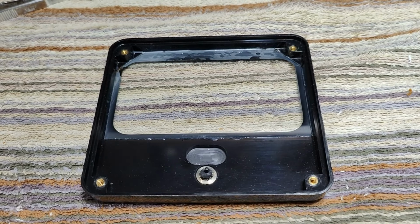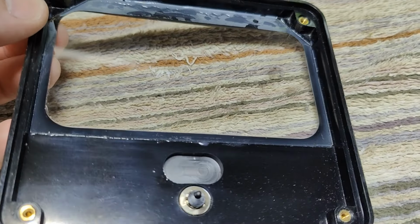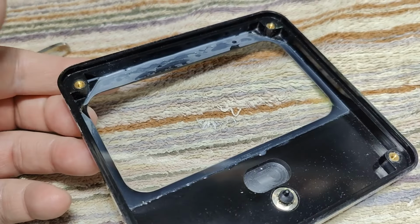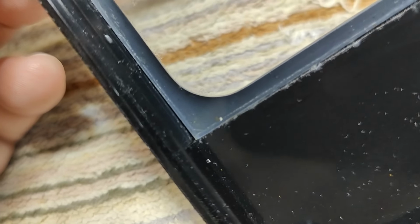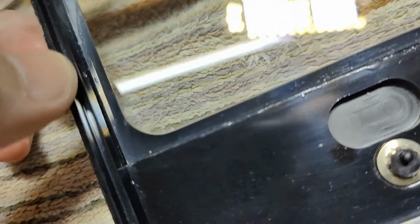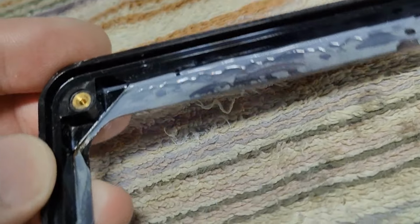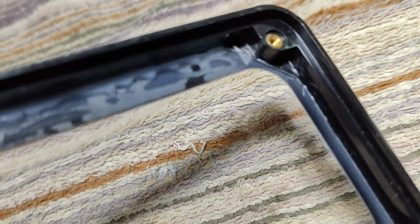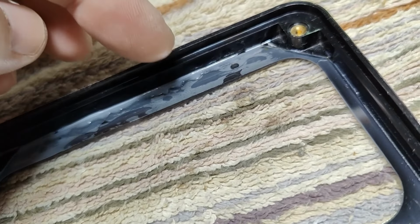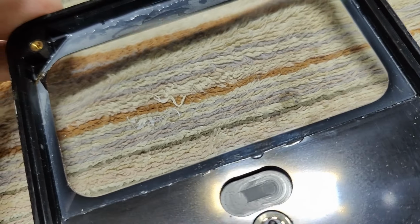Not good. I think I've been gluing glass into Bakelite using silicone, contact glue, all sorts of glues actually, over my time. This time I tried with UV curing resin and glue. And I mean, if you put in the right amount down here, the glass also went all the way. Look how beautiful that looks. The glue is just perfect. Up here, the glass couldn't go all the way down, so I had to put in a little bit extra glue. But I can see up here that it sucks all the way in. And here it cures in a little bit thicker layer. But it is really, really easy to work with. What a good thing. I'm never going back.